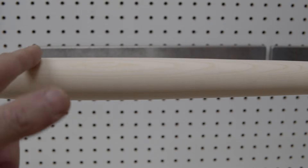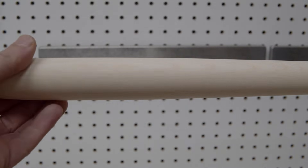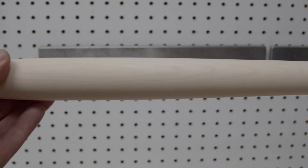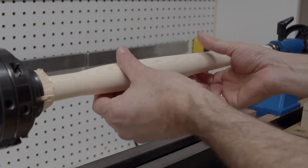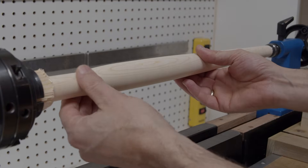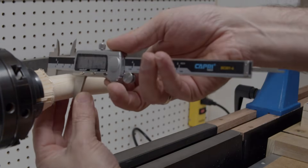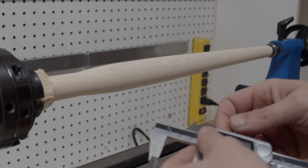So this is right after cutting and sanding — I started with 120 grit and ended at 220. This looks pretty good. There are a couple of little bumps that I think came from the hose getting tangled up, but otherwise it's pretty good and I'm not seeing any big tearouts. This part is a little rough — where it's going into the end grain it's getting a bit beat up, but there's not a lot of tightness to the end grain in softwood, so that's to be expected. I'm going to check the tenon — I want it to be one inch for the chair seat.